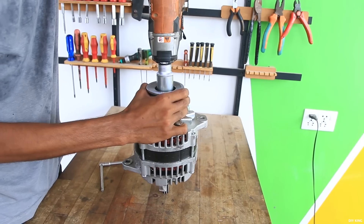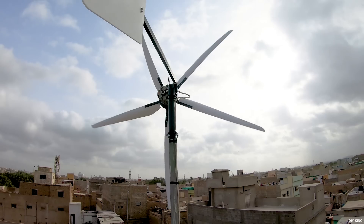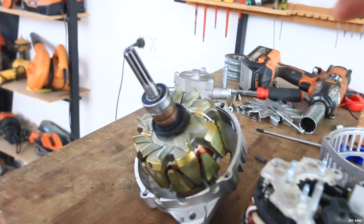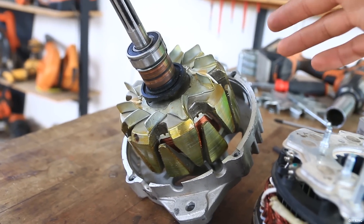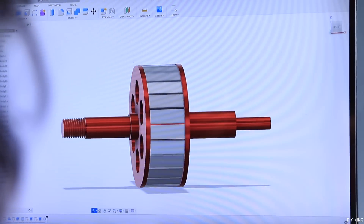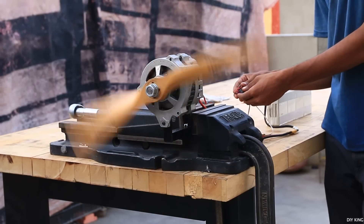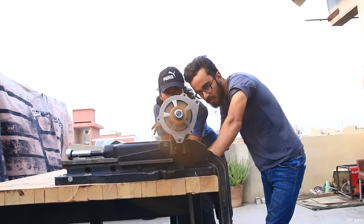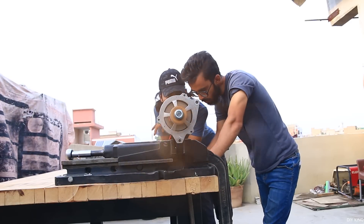We built it completely from scratch, but even though we used a 24-volt alternator, that thing needed way more speed than what we had anticipated. Besides that, we have to energize the rotor in order to magnetize it, which in the case of a wind turbine is a complete waste of power. So in this video we are going to convert a car alternator into a permanent magnet one, to see if it's worth repurposing as a generator — or who knows, we might end up converting it into a powerful brushless motor. We have different opinions on that, so we are expecting different results.